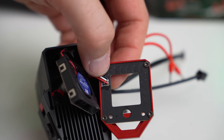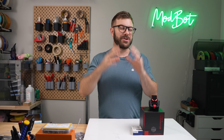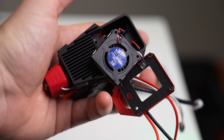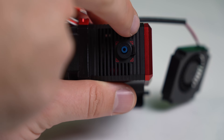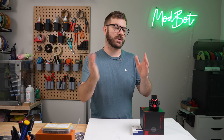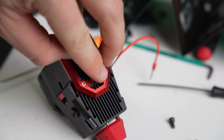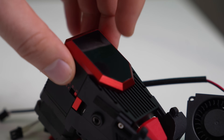The other part that I really struggled with was the RGB LED plate. There are three wires that I did not realize were soldered to the back of it. I don't know if the soldering just wasn't great from the factory or if I was a bit rough on it, but I did end up pulling one of the wires off when trying to put everything back together. I ended up removing all three wires, cleaning up the pads, and re-soldering them in place. It's a super tight fit, and I noticed when reinstalling the plate, I have a hairline gap on top — I think it's because I used a bit more solder than what was already on there from the factory. On top of that, the adhesive on the magnet for the faceplate came off when I removed the front cover, which I know was just not adhered well to begin with. This should be a simple fix, and the faceplate seems to stay on pretty well with just friction.